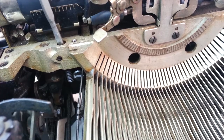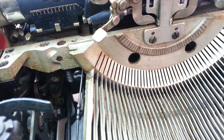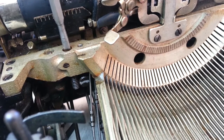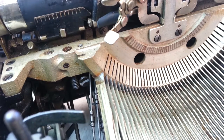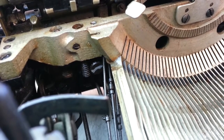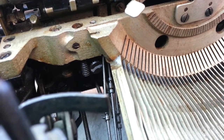So I'll see if I can remember that. I'm going to put it on video so I'll be able to reference it without having to take a look myself. Counterclockwise with the screwdriver tightens the mainspring. That's my quick video on mainspring tensioner on a Royal Standard Typewriter.